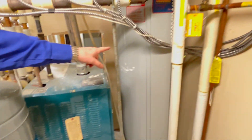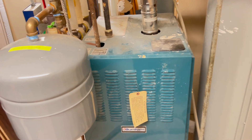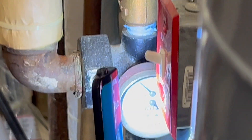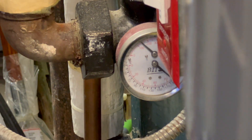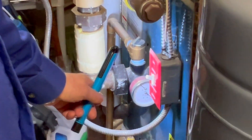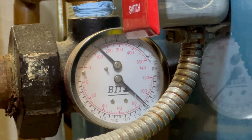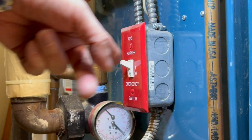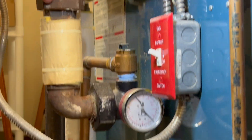What keeps the water in the tank extremely hot is hot water from the boiler. The boiler thermostat is set to 190 degrees — just below boiling — and the second needle on that gauge shows the pressure inside the boiler. This blue container is the boiler. The emergency stop switch is here, which kills the electricity to the boiler. The output of the boiler — hot water at 190 degrees — comes up here.